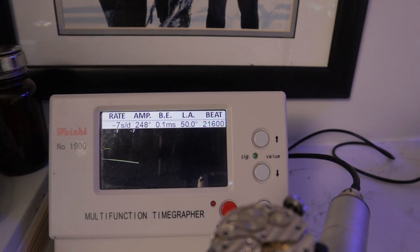You need to allow the changes of gravity and friction to take place in the movement to get accurate screen data. When you begin the adjusting process, look at rate in two ways. The first is what you see on the screen — the instantaneous rate — which is a prediction of how well that movement will keep time in that one position. The instantaneous rate is used primarily for regulation.